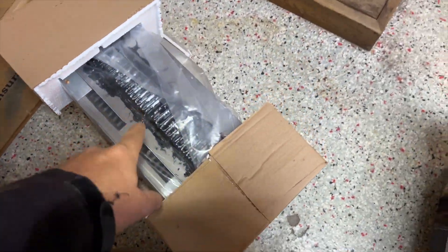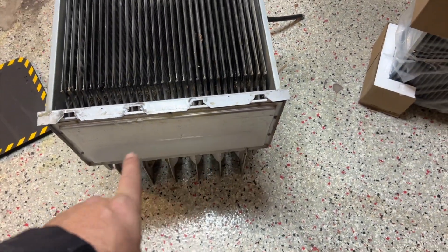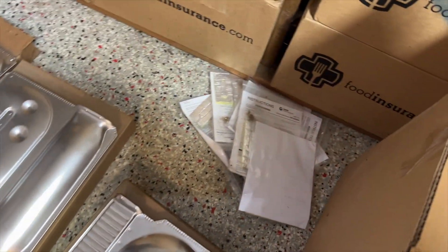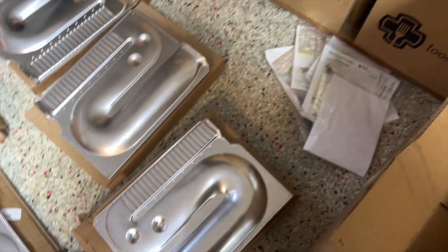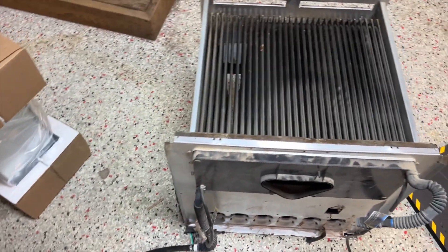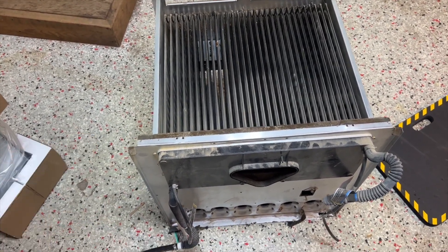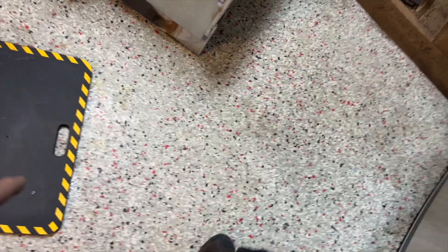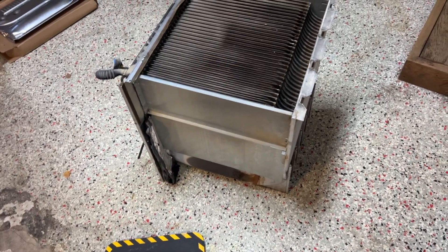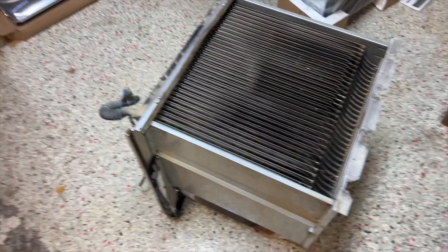This is our secondary — this is the back side, this section here. This plate we have to take off and put on the new one, which is ridiculous. The primary heat exchangers each come with a little bag that has a gasket for each side, and brand new self-tapping screws that are already pre-started. It's always good to get the full heat exchanger assembly including the front plate and back plate. Honestly, if I find even one compromised cell, I'm going to change the entire heat exchanger.